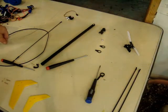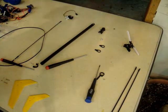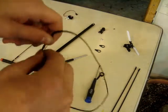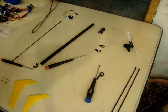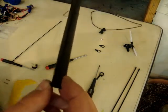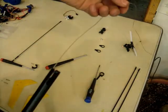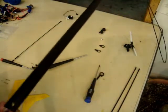To install the belt, you'll need a pretty long piece of wire — longer than your tail boom. Take your belt, just wrap it around like this, make a little hook, twist it around. So you have your belt on a long piece of wire. On one end we have two holes, and on the other end we have a slot and a long oval-shaped hole. We're going to stick it through the oval-shaped hole side and have our wire come out.